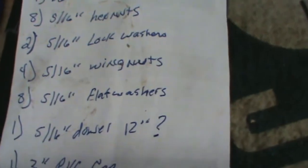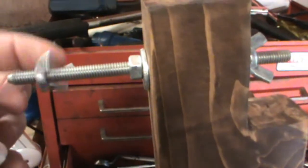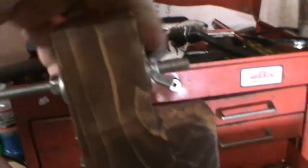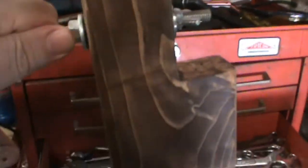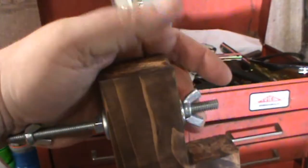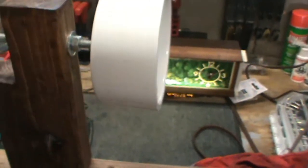Wing nuts — this is where I shorted myself and I wish I didn't. Get 4 of them. You need one, two, three to adjust your stock, and then the fourth one would be right here to make this adjuster easy. Instead you've got to loosen this up, come over here, loosen this. If I just had a wing nut there it would make life a lot easier. So ditch the hex nut here — don't use that, use a wing nut instead, as well as right here. It will make your life a lot easier. That's a tip for us lazy folks.